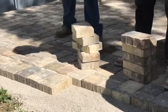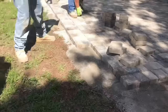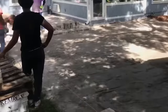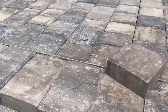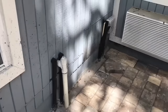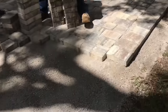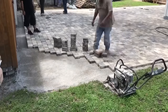If you look to the bottom left of the screen you can see the six-by-nine pavers oriented 90 degrees to the patio. These are used specifically not just inside the paver patio, but to make a border all the way around the whole thing. Essentially a third of the paver patio is completed and it's 9:30 in the morning — about an hour and a half in. This string laid down gives them a visual reference on how to lay the pavers and also ensures drainage is properly managed.